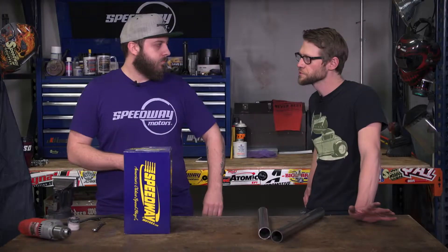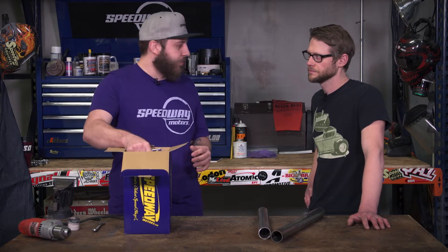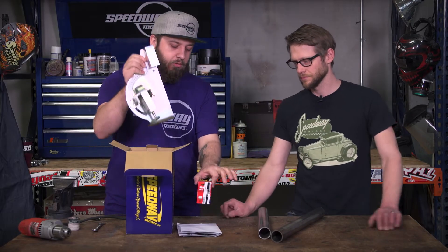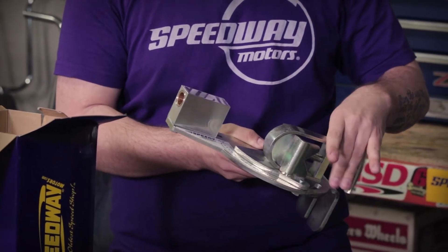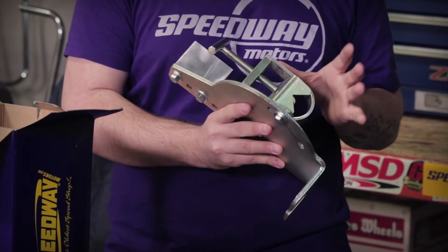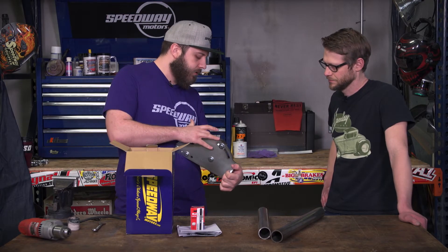There's a trick to this thing when you first pull it out of the box. With these units, what a lot of customers sometimes get confused about is when you pull it out of the box — you'll pull out the instructions, it does come with its own hole saw, it will be inch and three-quarter. The biggest thing to note is when you get it, the rounded portion will be on the flat side of the clamp. You actually need to loosen it and rotate it around so that the rounded portion is on the V side of the clamp. If you don't, then the set screw here will actually put a dent or a kink in your tubing.